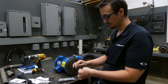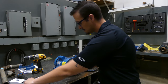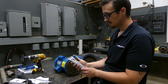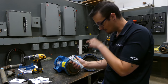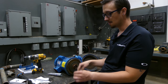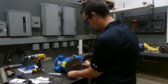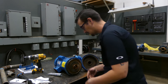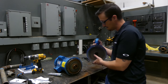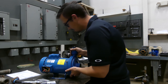So we're putting a little bit of lube on here. This is Super Lube that we're using — a multi-use synthetic grease, so non-petroleum based, and it's also food grade. Even if this were a water pump, this would be a good grease to use on that. We'll throw our new gasket on here just like so, and now we're ready to bolt the pump back together. We've got everything cleaned up and we're ready to put this all together.